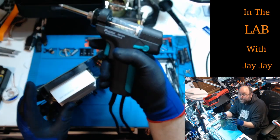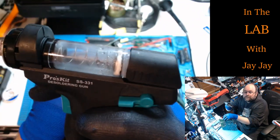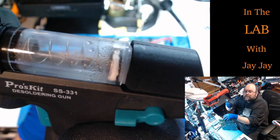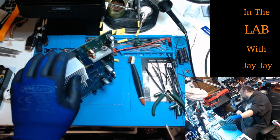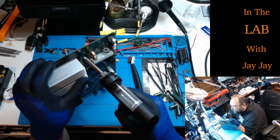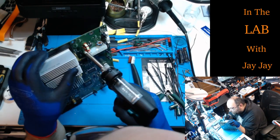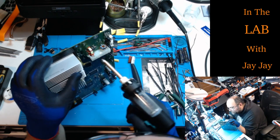Oh, look, I've sucked in a whole lot of flux. Can you see the flux in there? Sort of fluid. You can see it looks like condensation. That's interesting. All right, the temperature is up to 346, 347. So it's pretty close to where we want it. Let's give him another go. Yeah, that worked quite well. That didn't work so well.